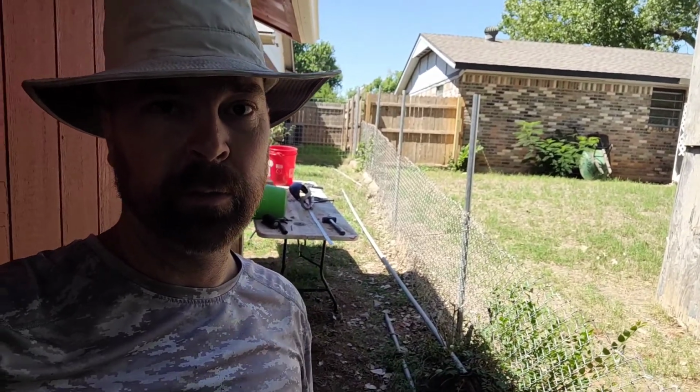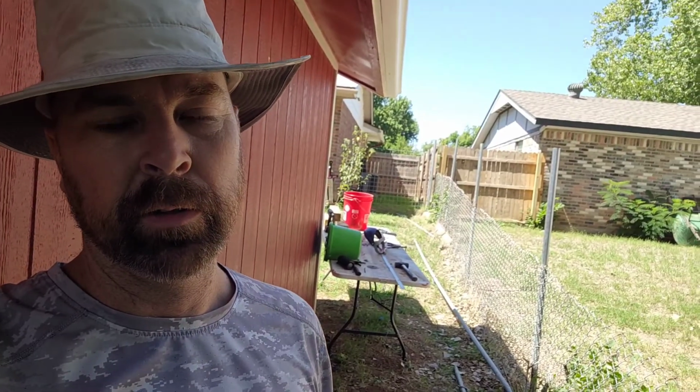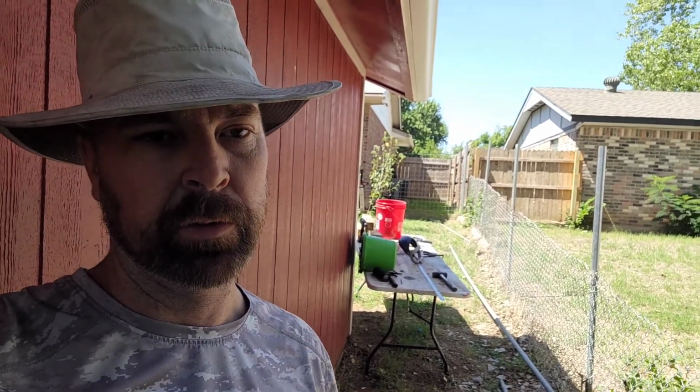And hey, you can get a respirator if you want to go that far. I would just say cut on it outside. Don't be working directly over the stuff. You can use a Sawzall. That'll cut the stuff a lot cooler than a grinder will. A grinder gets it so hot that it releases those fumes.